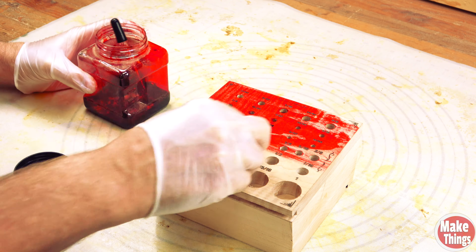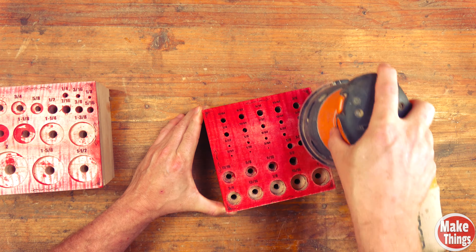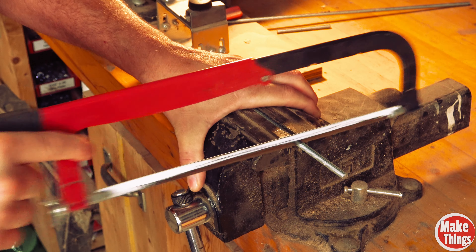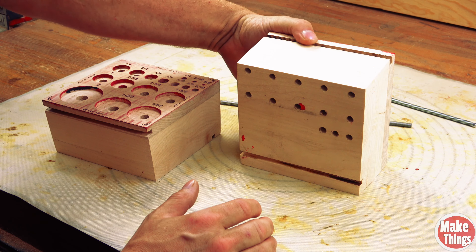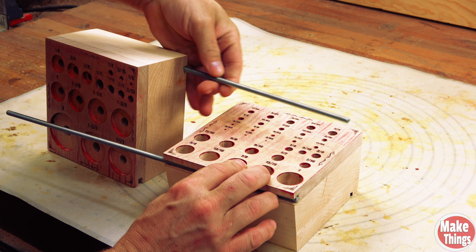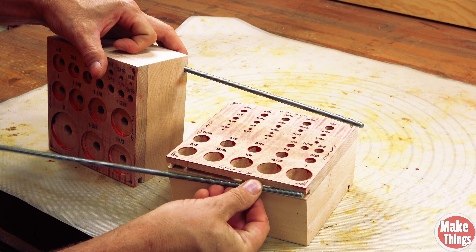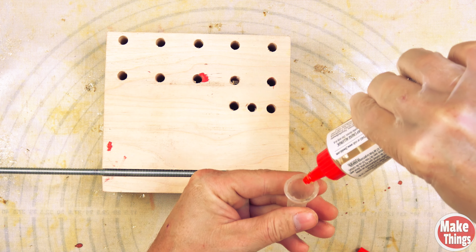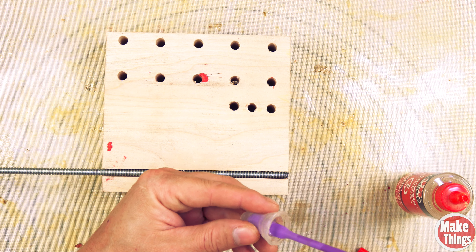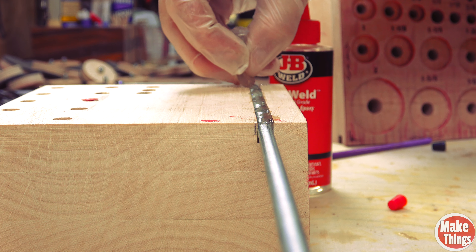I'm adding a dye, but as you've seen so far, it's only to bring out the depth of the curly maple. Most of the coloring is sanded off. Next, I cut a couple of threaded rods to size - the column length and the length of the two blocks together. I wanted to keep things very simple so that I can easily detach this if I need to use more of the drill press table. To do this, I epoxied a rod on one block and the second rod on the second block. I added epoxy to the bottom of the channel as well as to the rod on the top - these things won't come out anytime soon.